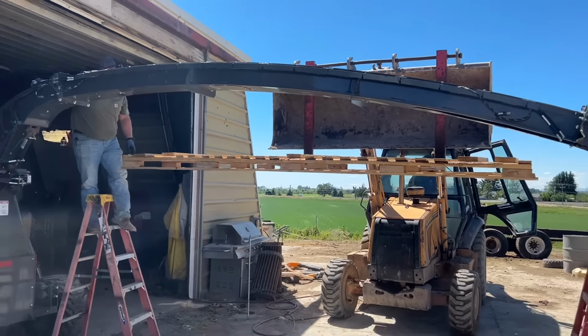We're having to do, as well as put that spout on, is these are all the knives. So this is a new knife and this is the old knife, so they're pretty worn out, if you can tell how much is on that one versus that one. So we're in the process of changing all the knives. We already changed them on that chopper with the big spout on it. This one doesn't have a spout, but we're changing the knives on them, and then we should be good for next crop.